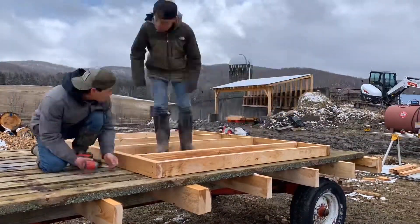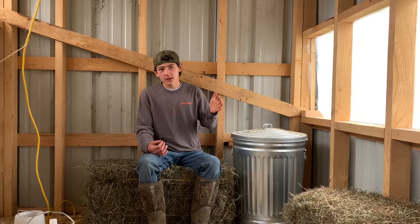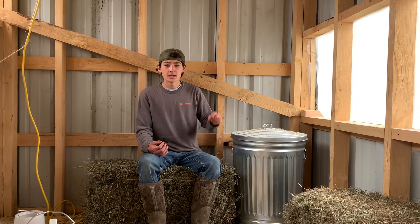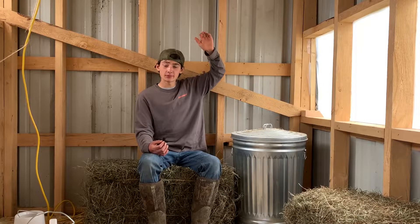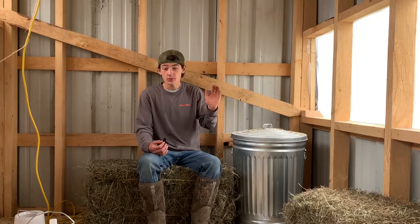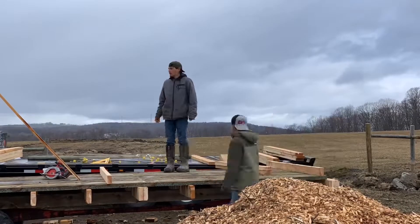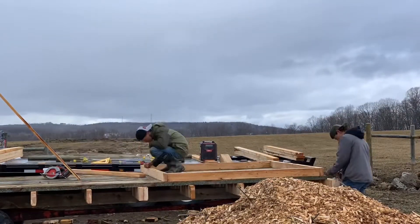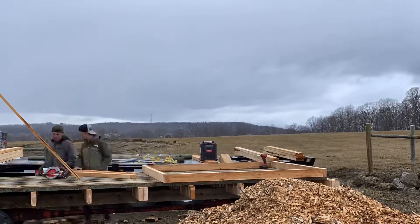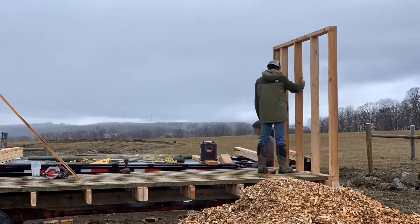We decided to do the small walls first and then the big walls after. The small walls are pretty easy — they're 8 by 6 and a half feet. The height is just whatever you want. We thought 6 to 7 feet was enough. The 2x6 rafters add some headroom for you and the chickens, because the roost poles will run so their heads can go up between the rafters, giving us more space to walk inside. All the lumber in this project is rough cut, so it's all dimensional — exactly 2x4, 2x6, 1x4. It's heavier but stronger — it's all hemlock and it'll last a lot longer than Home Depot wood.